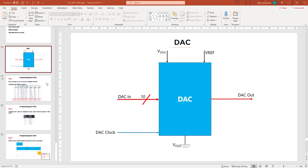Today we'll be looking at the digital-to-analog converter inside the LPC2378. This is one of the easiest peripherals to use. It is a 10-bit DAC, meaning you get a 10-bit digital value and the corresponding analog output. The DAC also has a Vref, so the output cannot exceed Vref and cannot be less than zero — meaning no negative output. The DAC uses a clock, but the digital-to-analog conversion itself is based on a resistor ladder which doesn't require a clock, so the clock doesn't directly impact the conversion.